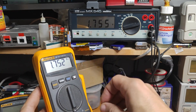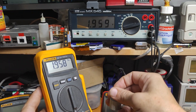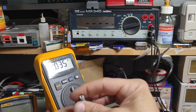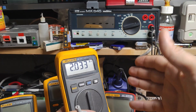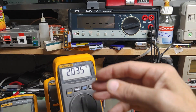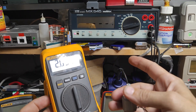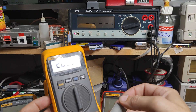Around 1.7 to 1.9 volts, if you increase up to 2 volts, it's still not able to see. So the efficient probing voltage for this multimeter is about 2 volts. The manufacturer could make improvements by increasing the readable voltage range from the component being checked, which would allow reading diodes, Zener diodes, and similar components more effectively.